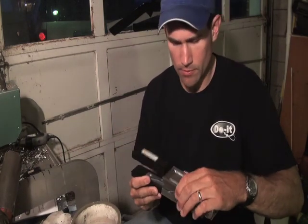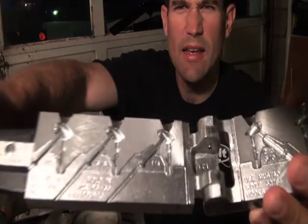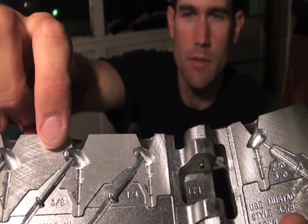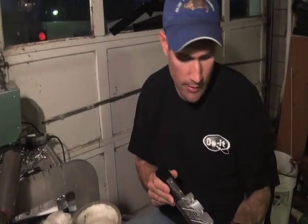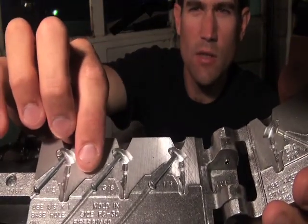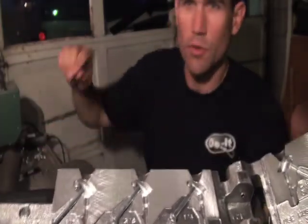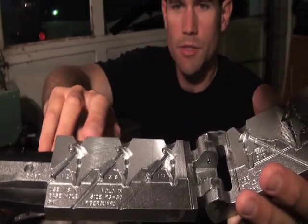This particular mold — I'll show it to you with the pins in it — is designed so that the lead kind of wraps around the eyelet. So it's especially suited for punching down in vegetation and coming back up clean. What I'm going to do is, where these pins are for the wire weed guard, I'm going to do a little bit of modification to the mold itself — some dremeling, I'll show you that here in a moment.